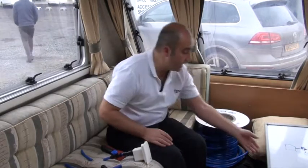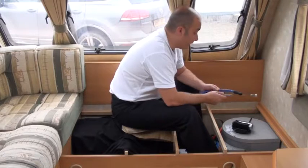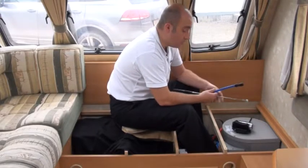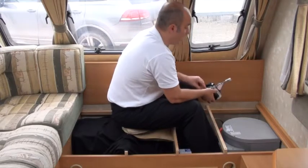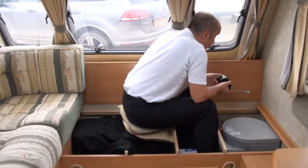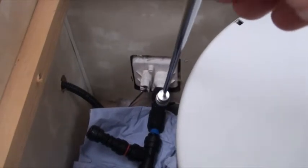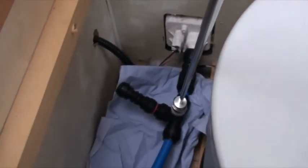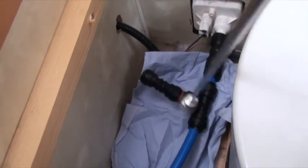Let me just fit this back up and show you how it works. Here's our original piece — I've removed the straight connector since we didn't need it. I'll set it in here for safekeeping so if I ever remove Flow I can put it back. Now, looking at it fitted on the handy cam: there's the little block in the wall, the one-way valve fitted next to it — though we didn't actually need it here, I've done it for demonstration. There's the Flow T right next to it, as close to the source as possible, with the pipework running back to Flow. Ready for the airline to push-fit straight in.